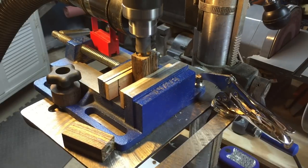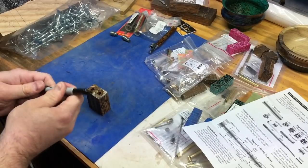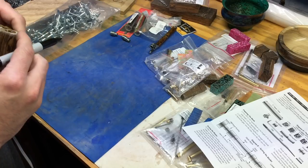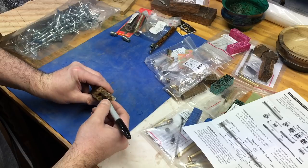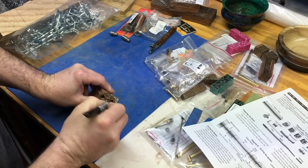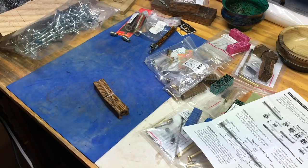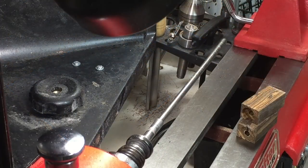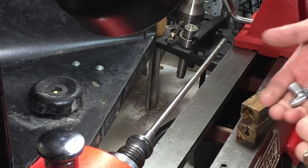I'll square up all four sides of my pen blank. Later when you turn your pen blanks down, the pencil mark will be gone. So I'll take a permanent marker and mark the insides of the barrels on one side and a little bit on the outside, so when you turn them down later you can still see from the permanent marker how to align the grain.